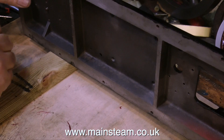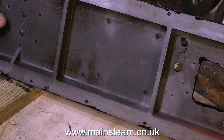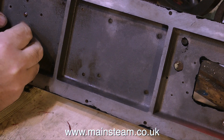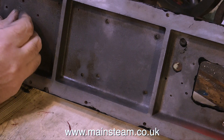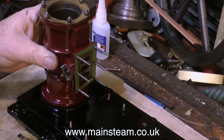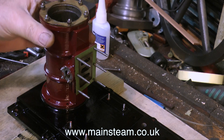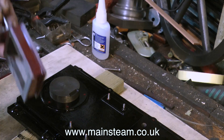This block is not what it seems — it tapers towards the drain cock, which I presume is to allow all the water to run to the bottom of the cylinder and blow out of the drain cock rather than lay about in a puddle. The block is held to the bed plate by a couple of nuts and studs, and the cylinder sits over the block before you fasten it down on the outer edge. The cutaway on the casting is just so it doesn't cover the steam port.